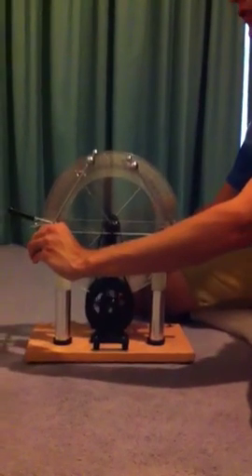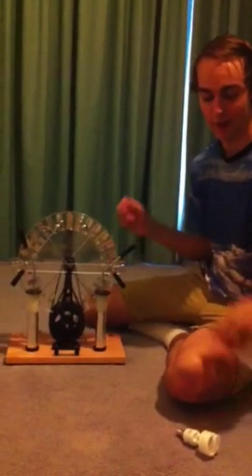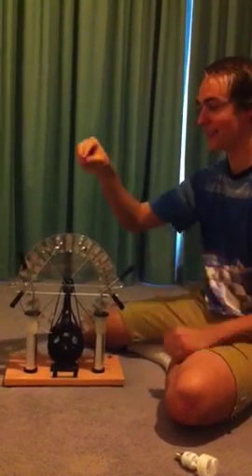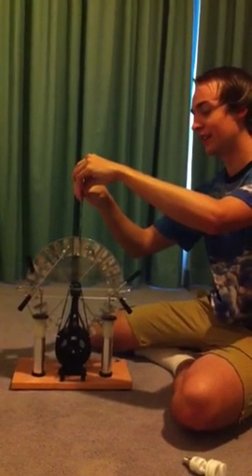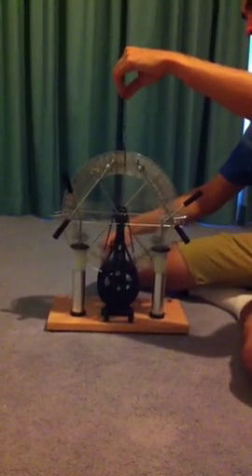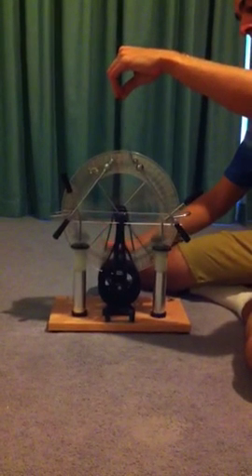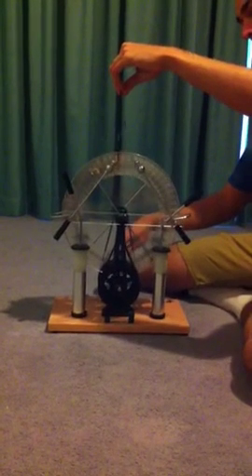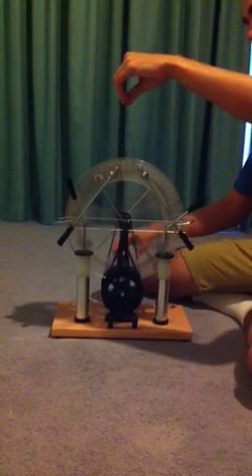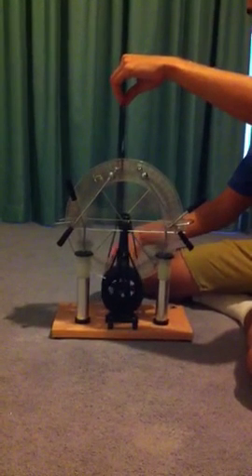So there's a few cool things you can do with this. First, I'll take the Leyden jars off. One way that you can visualize the energy going across is you get a piece of insulated foil — insulated by the duct tape on my fingers. If you just turn the wheel slowly, the foil will collect the charge from one electrode and then take it back and forth to the other one. Then it gets the opposite charge, so it's attracted back to the first electrode and goes back and forth.